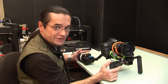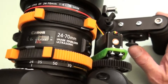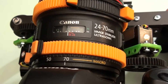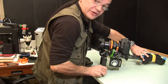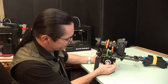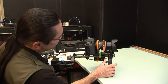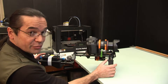What we need to do now is to set a limit of travel. We can get up to our maximum zoom — now I don't want it to travel any further than that. If I push the stick up further, the motor will try to drive that ring beyond the 70mm position. So I need to push one of the limit buttons — we want to set a maximum travel limit, which is button number two. I'm going to push that once. Now if I push the stick up, nothing happens — that's as far as that motor will go. Pull it down and it comes back. Full wide, full zoom, and the motor won't drive any further than that programmed limit.